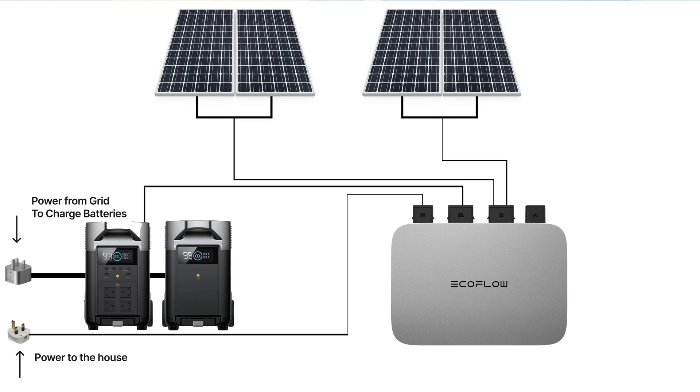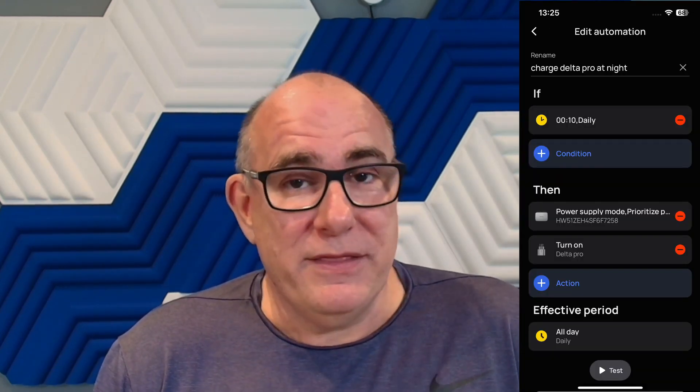There's another plug next to the inverter plug, connected to an EcoFlow smart plug, which goes directly into the batteries. The batteries are important because they help supply power when there's not enough solar. This plug allows me to grid-charge the batteries at night if there hasn't been enough power to keep them topped up during the day. A simple automation runs: it stops the inverter, turns on the smart plug to charge the batteries, then when they're fully charged it turns off the smart plug and turns the inverter back on. Otherwise we'd get a circular situation where the inverter supplies the house and the batteries pull that power back in.